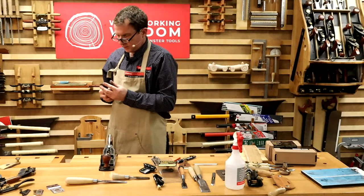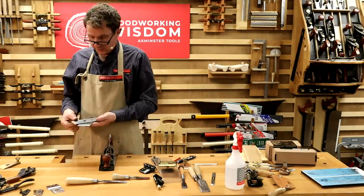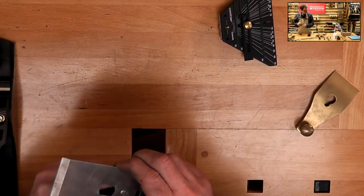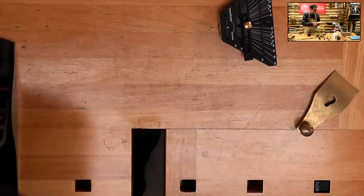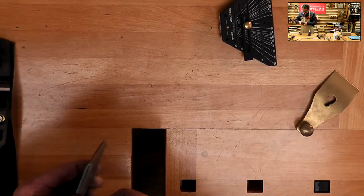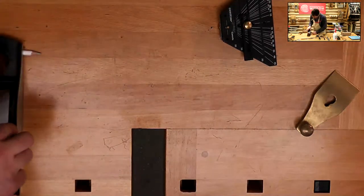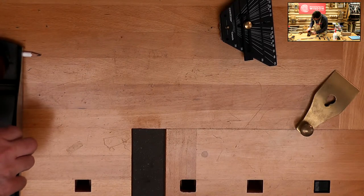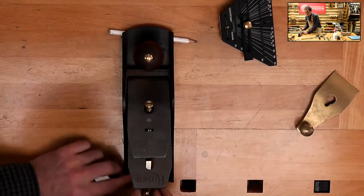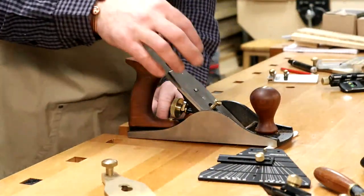Okay. Why do we need to do all this? Because sharp tools are easier to use. Now, 4.5 blade we did right at the beginning, being sat on the front of the bench there, tighten it up. I've come back about a millimetre, if that, from the front edge with the chip breaker. Tighten that in. Pencil in underneath, prop it up, makes it easier to put it in. Check it locates so I can do, sorry Ben, lateral movement on here. So I've dropped it in, got my movement, I'm checking the lateral movement, locates.